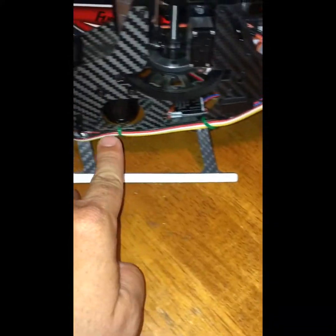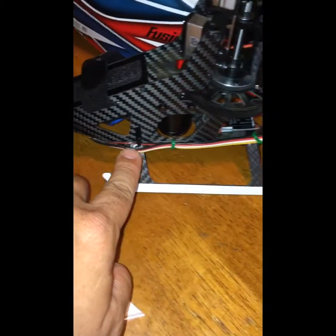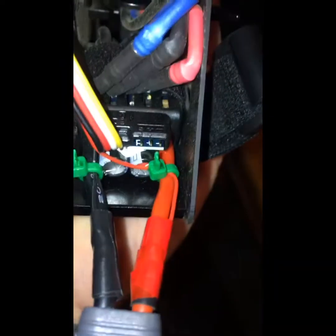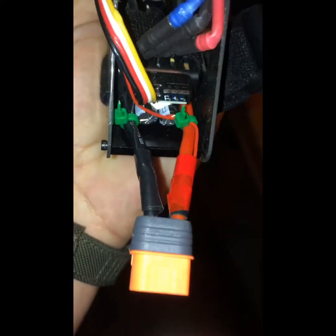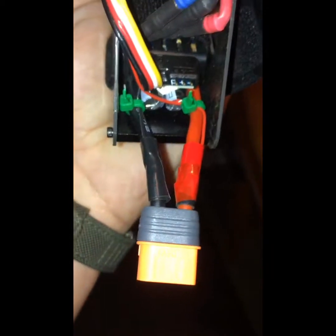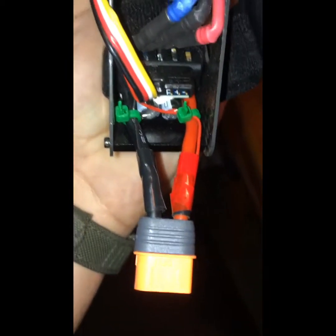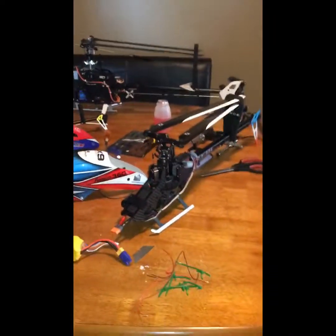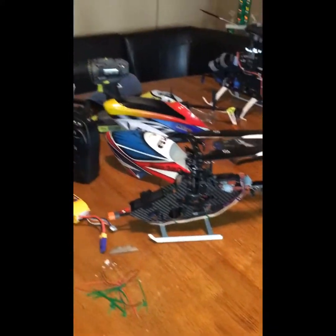After I pushed it in I really didn't want to remove it. I ran it around behind the speed control, comes around to the front, and I zip tied it at the base of the speed control power wires. Then I ran it up, spliced it — cut out a small spot on each side of the main lead, wrapped the sensor wire around it, dropped a bit of solder on it, and wrapped tape around it to insulate it. Now it'll plug in and give me the telemetry the way we set it up. That's the 360 and how to get it going with telemetry.